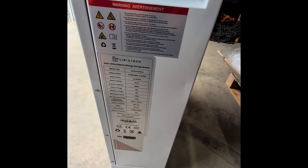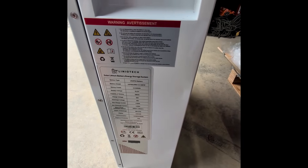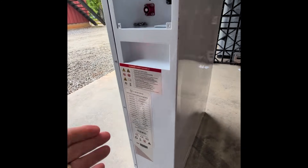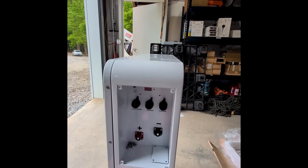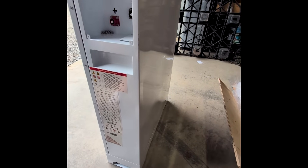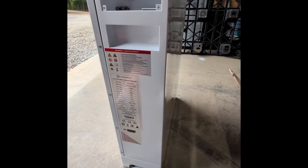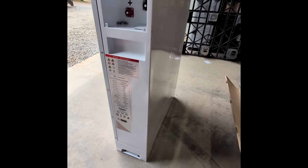This battery has 150 amp continuous charge current. If you're wanting to get the full power out of a 15k — which is typical for this type of battery — for a 280 amp hour battery, you want to check the charge current and discharge current. Two of these would work beautifully with a Solark 15k setup to get that full 275 amps out plus any surge. It has 8500 cycles at 80% depth of discharge — good, typical long life, good quality lithium iron battery.